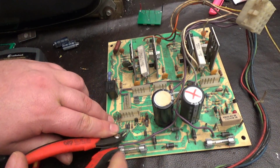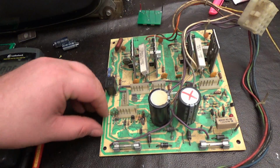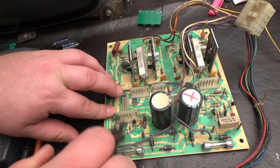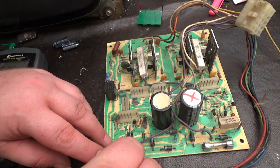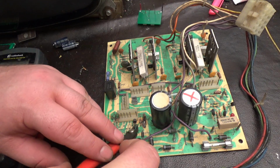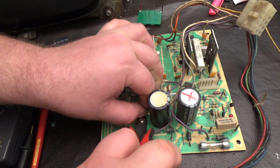Like I said, the difference between a 6100 and an Ampliphone is mainly the absence of the voltage regulator circuit. But another reason why you should never bypass it on a Wells Gardner 6100, you could, but you should never, is because an Ampliphone has way better cooling. It actually has a giant heatsink and so on, so it can handle that extra 10% of voltage. So long story short, if you had adequate cooling, you could bypass this, but I'm not going to. There's no reason to bypass this.